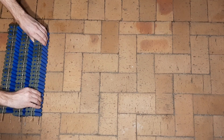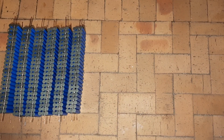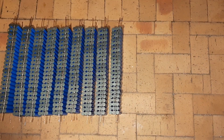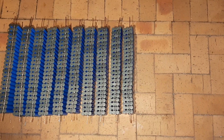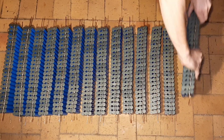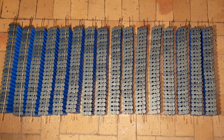Hi everyone. In this video I show the best way I've found to solder these three-cell packs together. I also discuss how to best connect the 16 packs together for equal current flow through all of the cells, and tell you how we will ensure that we have equally balanced packs before we start connecting them in series.